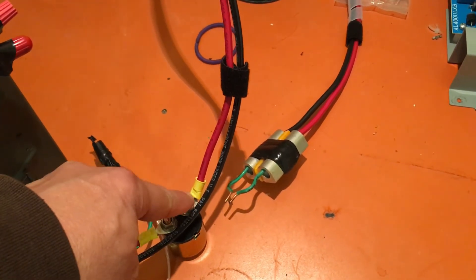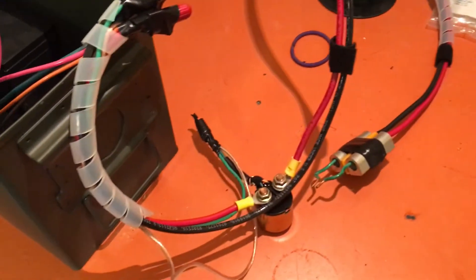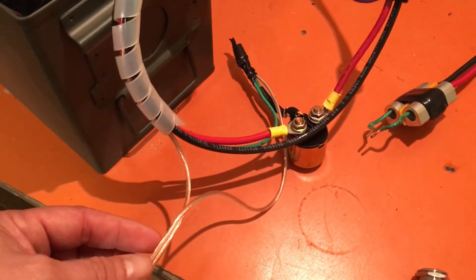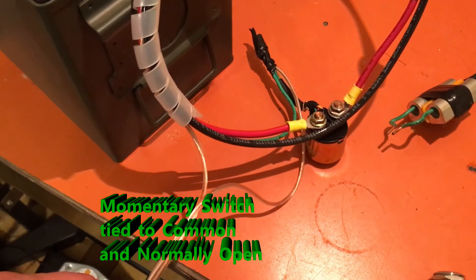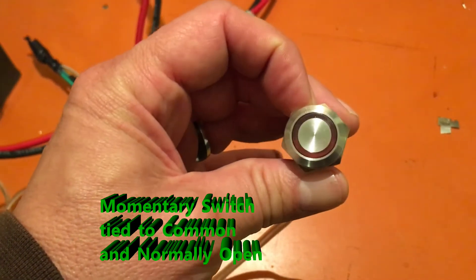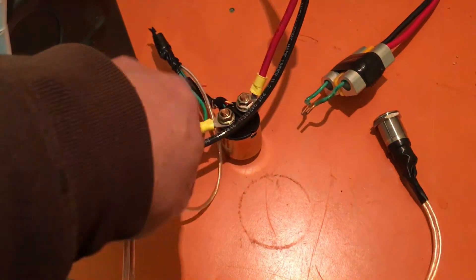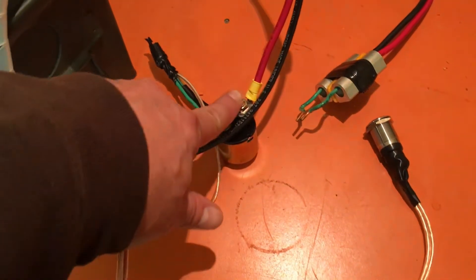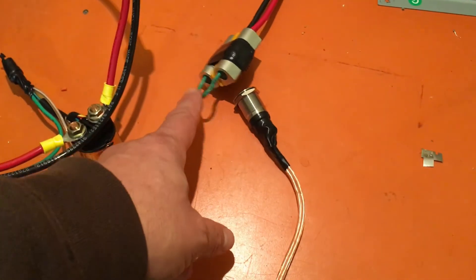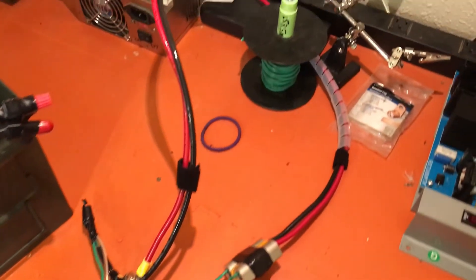I took a red 8-gauge wire and ran that all the way over to one side of the solenoid. Then the other side of the solenoid continues the red 8-gauge all the way to the other side of the tip. Lastly, I took this speaker wire, which is actually pretty thick, and since I'm only shorting 12 volts to it it should be fine, and ran that over to my contact switch. When I press this — since it's a common normally-open switch — I complete the circuit, which sends 12 volts to the other side of the solenoid, thus creating the short and completing the circuit to the tip of the spot welder. I'm going to draw this up to make it even easier, but that's basically the design.